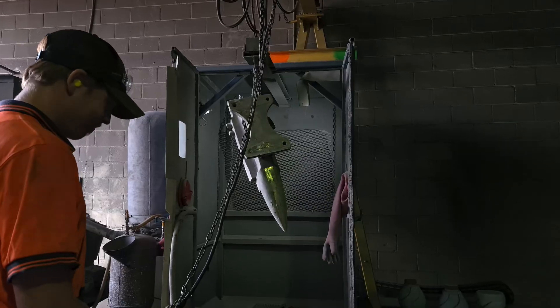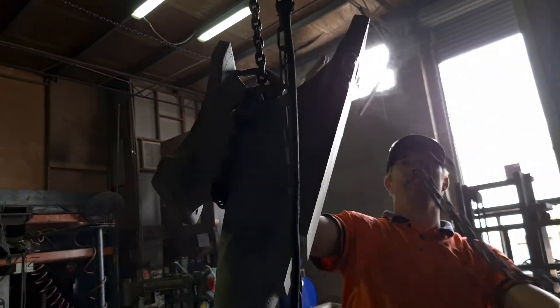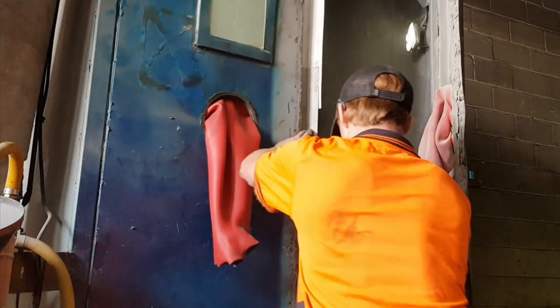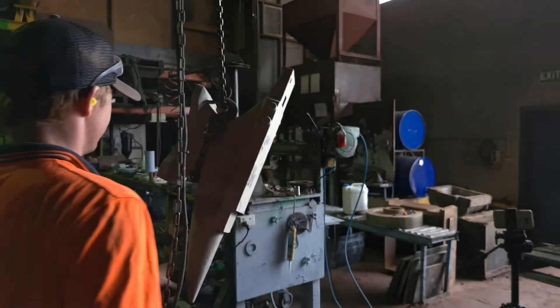What's the next step? Just give it a grind mainly on the horn, just get all the little divots out of it, and then give it a linish basically. You go over the body just so you get a nice paint job on it as well. You're just cleaning up any excess, any little imperfections from the casting. Make sure it's a nice smooth body and just so it's not so rough.